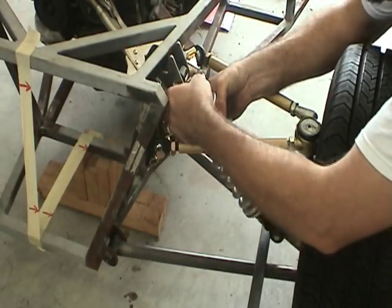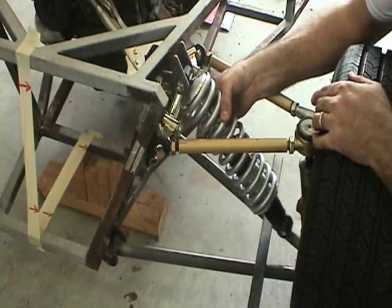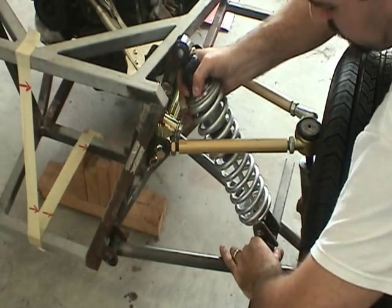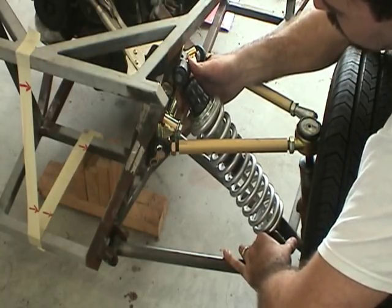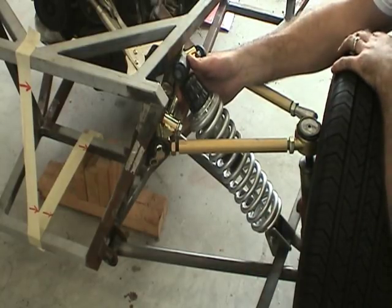And then the other thing is that because of this clearance, I found that the most effective way to deal with that is to invert the coilover, which means placing it in a position like so, and therefore providing plenty of clearance in order to be able to get to the cross member, not only for drivability but for serviceability.